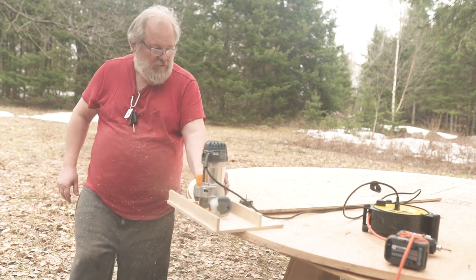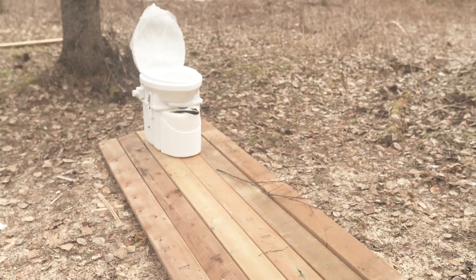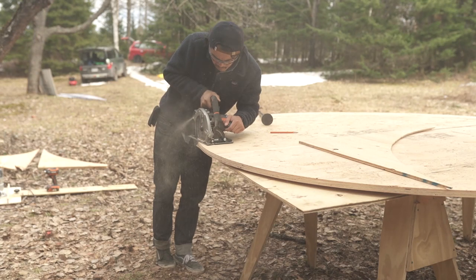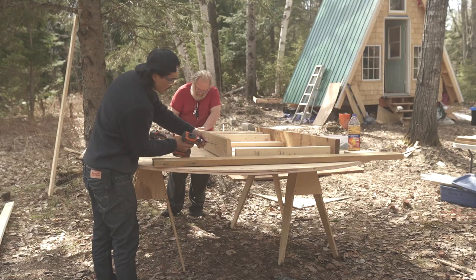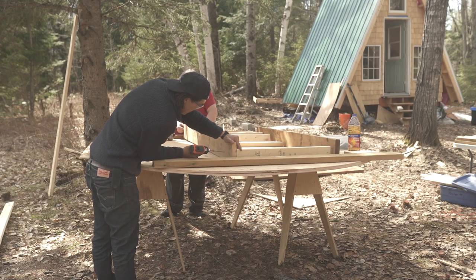From there, knowing that we wanted a flat base, it consisted of roughly six two-by-sixes — pressure treated. We measured out the sizing required and traced and cut this into the base of our barrel. We then produced the frame that the barrel would be sitting on, which would sit on top of cement blocks that were then leveled.